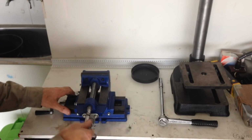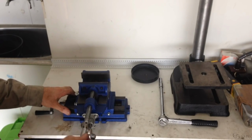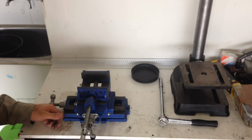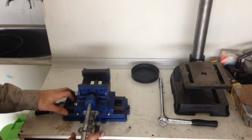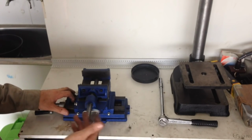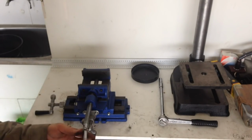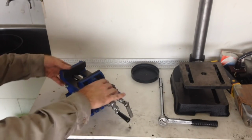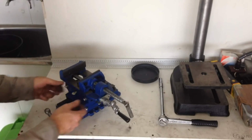And out of interest, when you screw the vice thread out, either change a workpiece or put a big workpiece in there. Interestingly enough, the knob clears the thread, so no modification needed to the slide knob or the vice thread, which I love. So this is a straight out easy conversion. So there we have it. Now we can adjust the gap and the play on both the slides, which you have to do when it's new anyway. I haven't touched those yet.